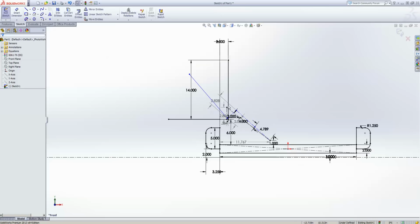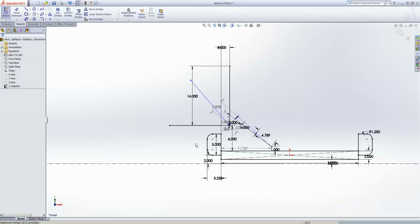So cool. So you have simple systems here. You can do this with arms. You can do this with anything really. Kind of one takeaway here is the trick of doing some angular motion from a pneumatic cylinder. The other takeaway here is you should model motion like this.